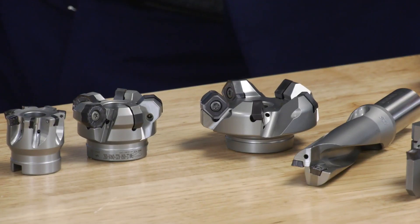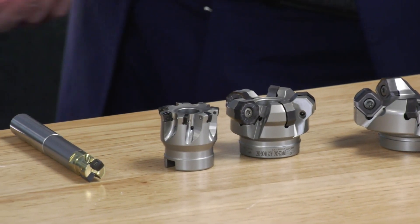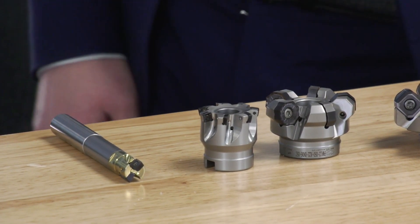How about milling — what's the difference there? So with milling we've got very good thermal stability, so it gives us a lot better tool life in some of the harder-to-machine materials like Inconels, your Hastelloys, and better cutting conditions so we can push the tool a lot harder.